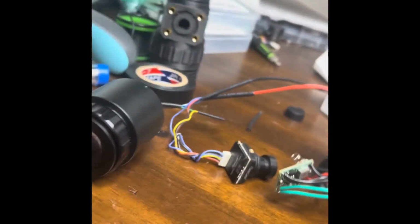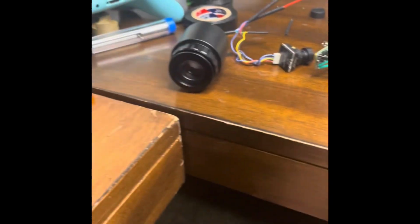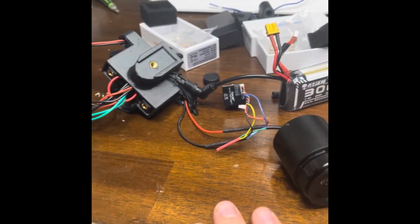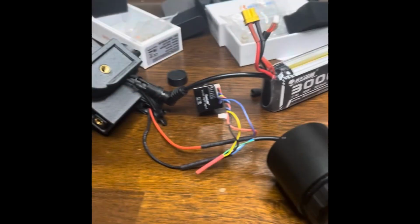Alright, so we've got both displays and cameras powered on. If you have a camera that doesn't power on, or neither of the cameras power on and it's black, but it was working when just one was hooked up, turn that voltage up just slightly. I checked my voltage on my multimeter and I'm running 4.91 volts, and that operates this whole system safely. That's the most important part, safely. Now I'm going to unhook all these connections and we're going to move on to the next step.